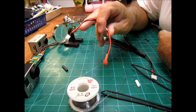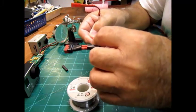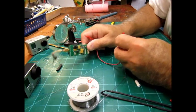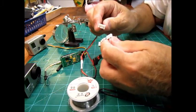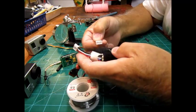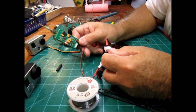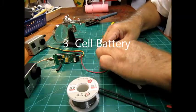Today I'm going to show you a quick tutorial on how to make one of these. What is it? Well, you connect it to whatever you need to run — for instance, here's the hot wire on our FatShark transmitter. We connect that to it, and to power it we're going to power it off the balance lead of our flight battery. We plug that into the balance port of the battery and we're powering the transmitter for the FatShark goggles to transmit your video.